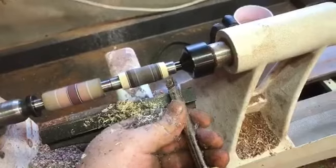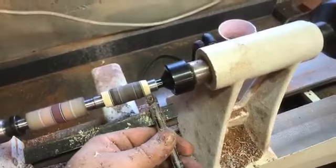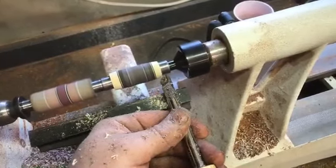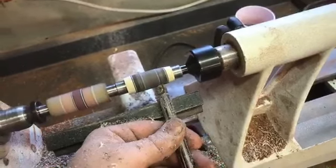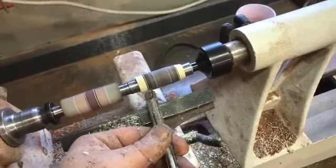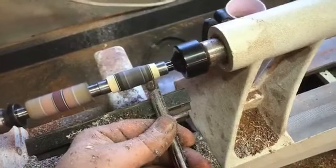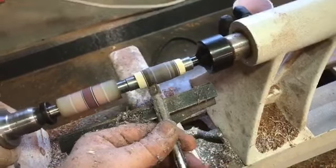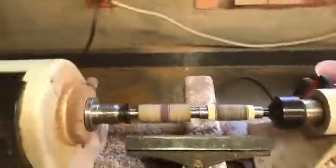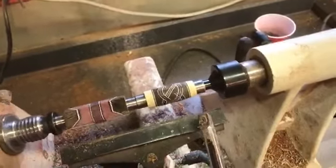Notice I actually keep this at an angle. The reason you keep it at an angle is because it shears a little bit better and you don't get any chip out, or it's less likely. It's also a pretty fresh carbide cutter. It does keep it super sharp. You don't need as much effort. Won't catch and cause an explosion of something you literally spent 2-3 hours gluing together.